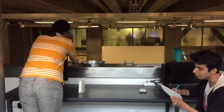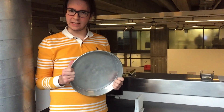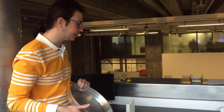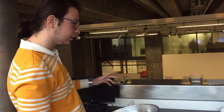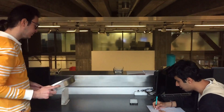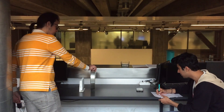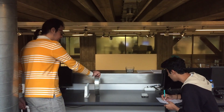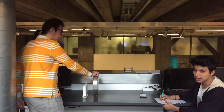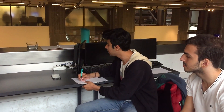Now we will use a steel baking pan to measure Wi-Fi signal. I have the steel baking pan. Are you ready, Agit? Yes. I'm putting this side toward the Wi-Fi router. We are waiting for measuring the data — it changed from minus 40 to minus 58.